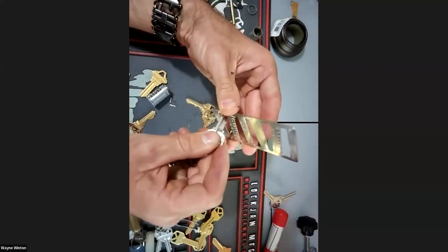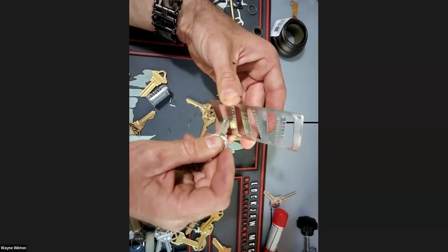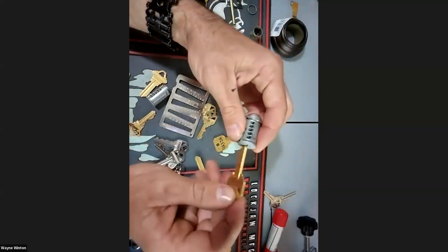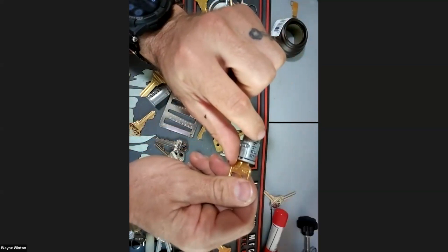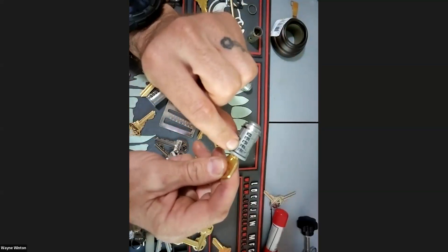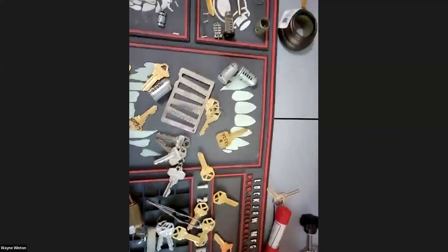we'd be sitting at 2, 1, 4, 3, 6. We can get all of that information just from sliding a key blank directly right in. So that's what a 6 is going to look like, just sticking way up out there, real nice and tall and proud. And then something a lot less, like a 1 cut, is going to be something like this over here. Okay. So once you have all that figured out, I'm going to shut this one off.